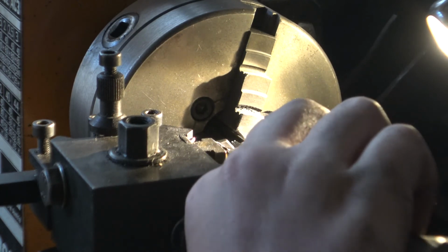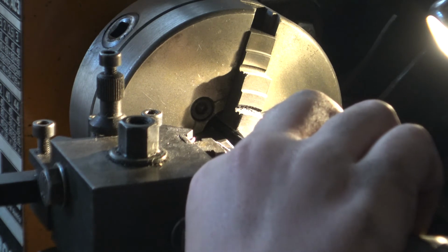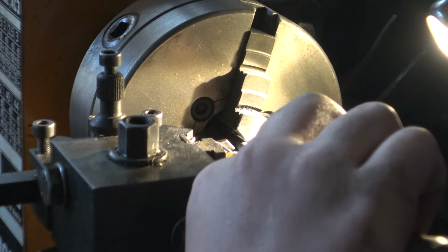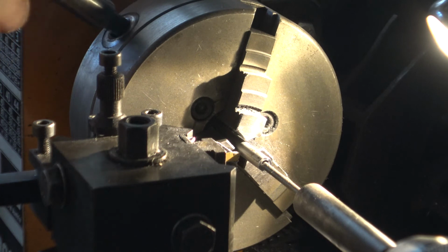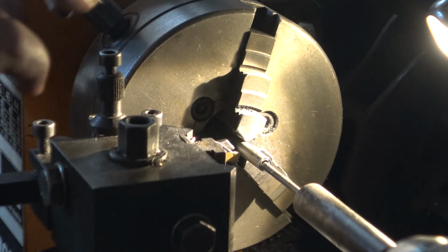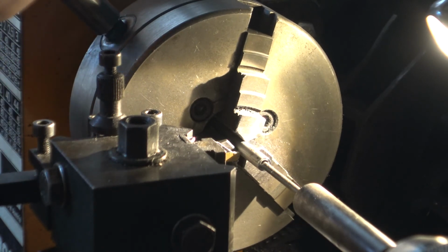I've set mine to 15 millimeters because that's the measurement of the thing. Then just push it forward to the ruler bit of your measuring tool. There. Once you've done that and got it perfect, you will need your chuck key, and you will tighten your chuck up, like so. Make sure not to undo it, otherwise you will have to remeasure everything again. Do it up nice and tight.